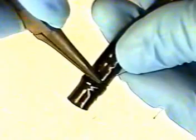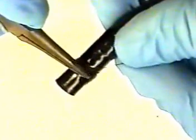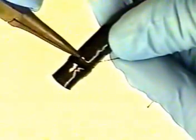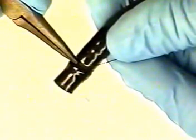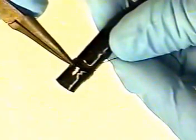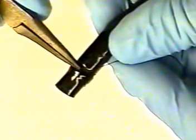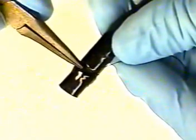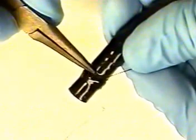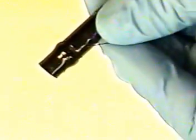If you pull the loop completely out of the bindings, you will have to repeat the procedure, because it should be very tight and right up against the distal end hood. Again, be sure that all these bindings are very tight. This binding should not allow any air to escape from the bending rubber through the bending section. It should be airtight even without the glue covering our bindings. Take your sharp scissors and cut off the excess binding thread, approximately 1 inch.